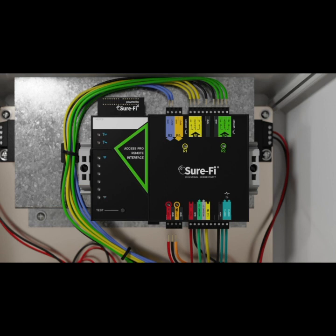Connect any locks or other actuators to the relay outputs on the top of the remote interface, R1 or R2. The normally open, normally closed, and common terminals on the relay are available. Each output on the remote interface has a corresponding input on the controller interface. Finally, connect 12V DC power. Additional devices such as a request to exit, motion sensor, or door position sensor can also be used by utilizing available relay inputs on the remote interface.